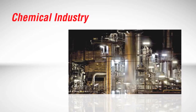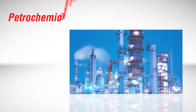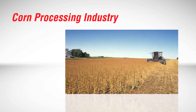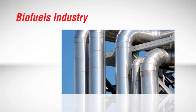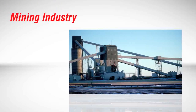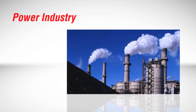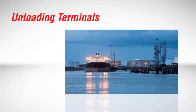Key industries that can benefit from ISC2 seals include the chemical industry, where hazardous and toxic fluids call for corrosion resistant materials and dual seal performance; petrochemicals, where ISC2 design standardization and large sizes fit a wide range of equipment; corn processing, where drive mechanisms must tolerate high viscosity driven torque and sticky fluids; biofuels, where economical and versatile designs accommodate multiple service stages; pulp and paper, where packed pumps can be retrofitted to significantly reduce leakage and water consumption; water and wastewater, benefiting from cost-effective yet robust single pusher seals; mining, where smooth geometry and hard face options reduce erosion; power industry condensate and circulation pumps using Plan 23 circulation; and unloading terminals, where seal face thermal management helps survive short-term dry run events.